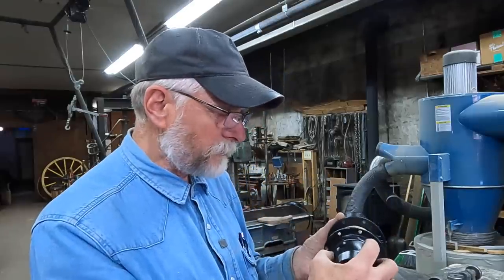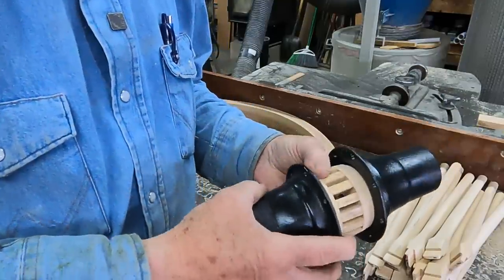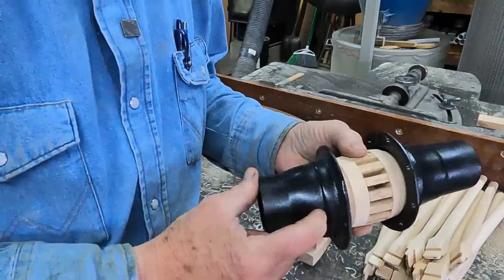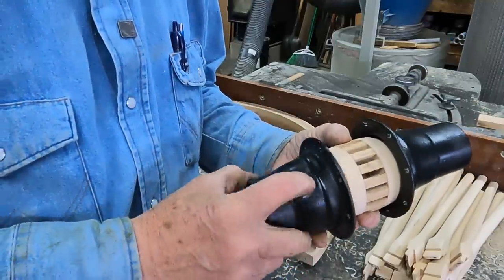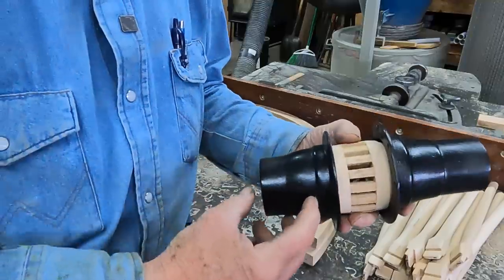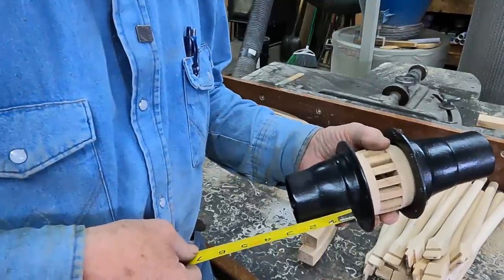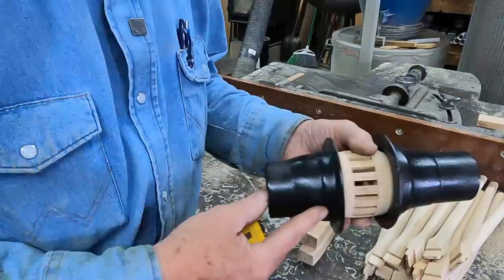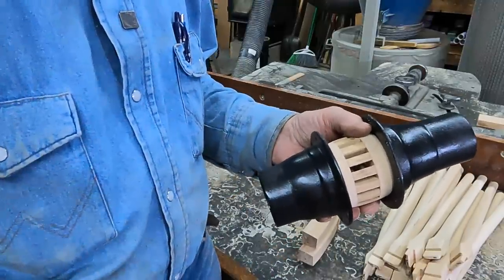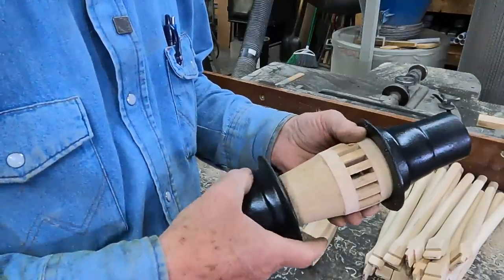So I think what I'll do is put this back flange into the metal lathe before I press it onto the hub core. And I can take a parting tool or something and cut it off right about this ridge here, which will take about 2.25 inches, it'll let it sit that much closer to the wall. Then when I press it on, I can take this hub core and cut it off wherever I need it.